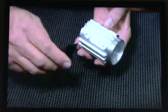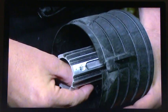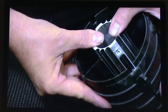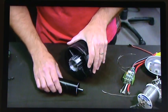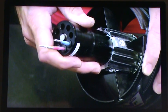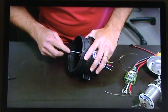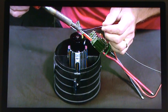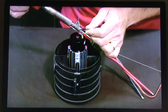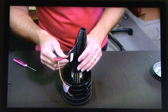Next, they build the motor. This one is a ducted fan electric system, a type used in smaller jets. The modeler first assembles the casing that will hold the fan and its motor, then slides air foils into the casing to create four ducts which will properly channel the flow of air. He slides the electric motor into the aluminum hub and anchors the assembly with a screw from the other side. The next part is a speed control mechanism — he solders its wires to those protruding from the motor and encloses the mechanism in a vented tube.